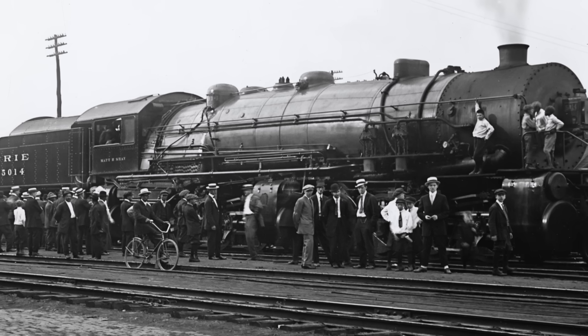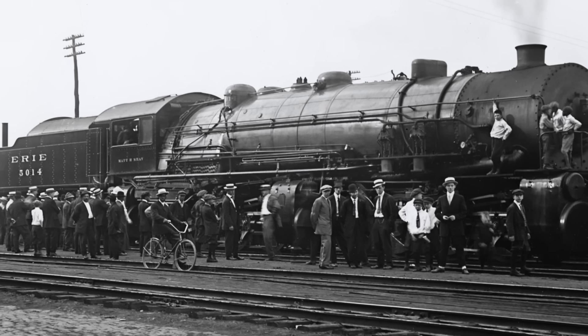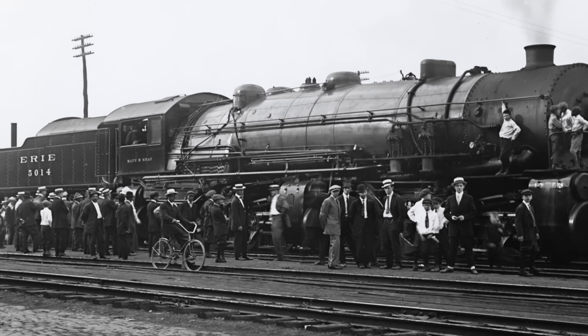She would later get two sisters in the form of 5015 and 5016. She had a massive boiler, because they knew they had to feed a lot of steam to these cylinders to make them work effectively. The high-pressure cylinders were actually in the center. The right-hand high-pressure cylinder led forward to those low-pressure cylinders, while the left-hand high-pressure cylinder went backwards to the low-pressure cylinders in the rear underneath the tender. Technically these were powered tender units, but they weren't interchangeable — you couldn't take the tender off without ruining everything. It was integral to their function, which would technically make these tank engines — just a weird thought. And of course they were articulated, because that wheelbase would be impossible if they weren't.